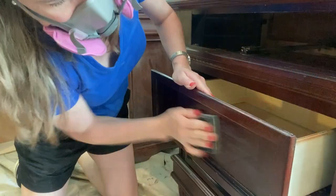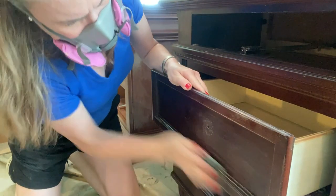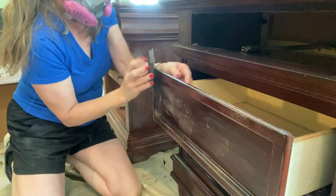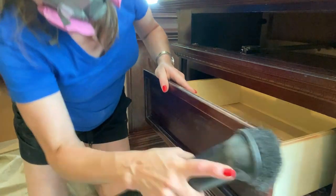I came indoors and I started scuffing these two side tables with a 220 grit pad by hand. There's no damage on these pieces — I'm just wanting to roughen up the surface to give the primer and paint some teeth to hang on to, and I'm vacuuming it up as I go.